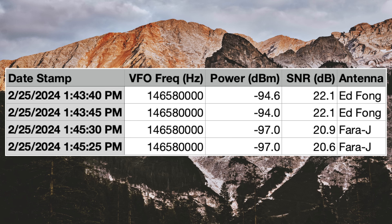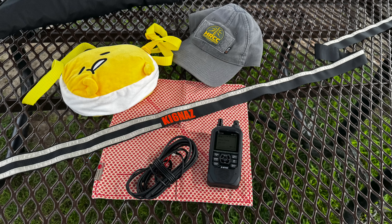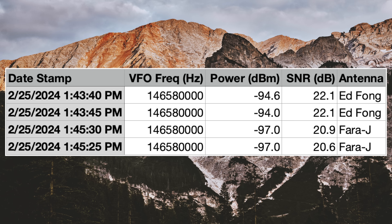Really interesting point: while we didn't pick up the Fara J on 70 centimeters, I found out after shooting this video that the Fara J is adjustable using those 3D printed hangers — basically taking out portions of the antenna by folding it back over the top of that ribbon using the little slider. I'm actually able to dial in a really good SWR on 70 centimeters. So that's something we also need to test on video, and that's likely going to be the no-holds-barred throwdown test of all J-poles. My tree-throwing method is the better one — we can lock in elevation really easily from the tree.